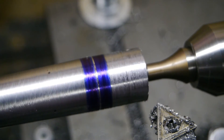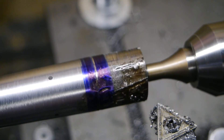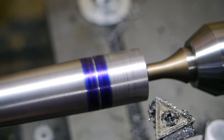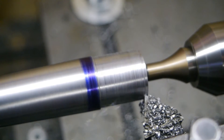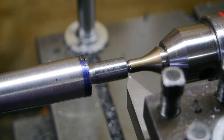I need to cut down about 19mm of this side — that will be long enough for the threaded part that needs to go into the chuck. I finished turning the part down to size and I'm getting ready to cut the thread. I got a new 60 degree pointy bit, I got the correct gears, and I should be ready to go.